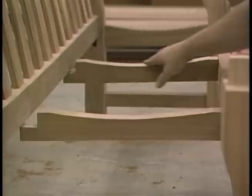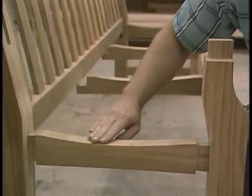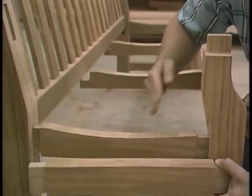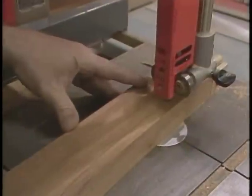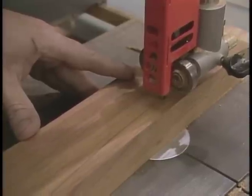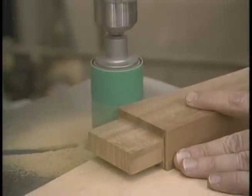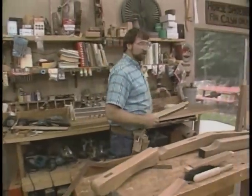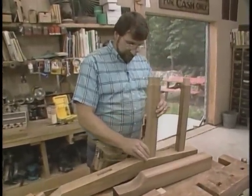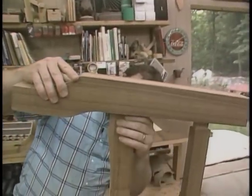Have a look at the seat braces here in the middle and these end rails. They have a slight curve downward to give the seat a nice, gentle look. I've traced the outline on my rail, and that's another job for the bandsaw. Now it takes care of smoothing out that cut. I just want to dry fit the pieces together — this rail goes into that mortise, and we take the front leg, and that slips on here.